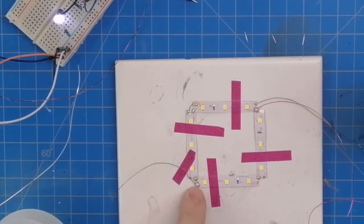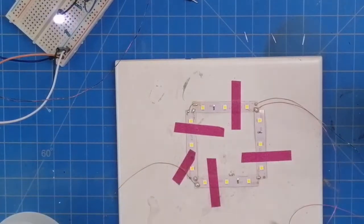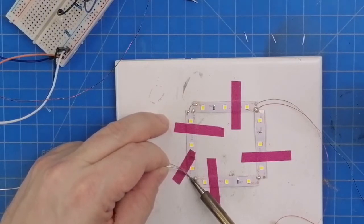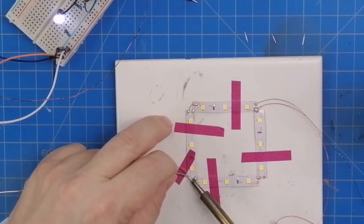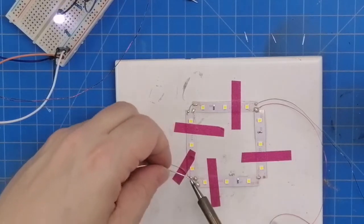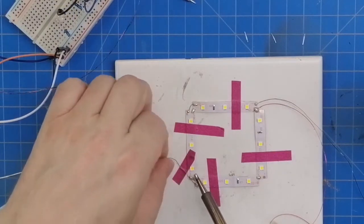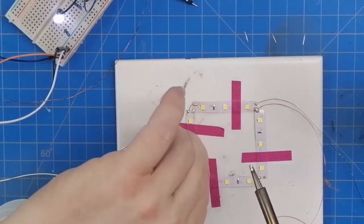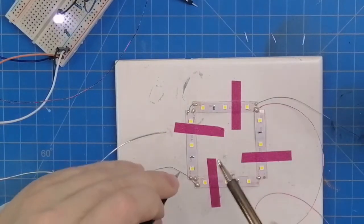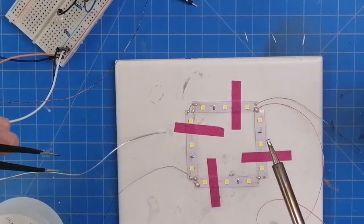So this is the one that I did inadvertently off camera. This is the one that I'm about to do. There's some buildup of solder on the tip. See there, the wire is fighting with me, staying outside of the solder bubble. So let me get the wire. Actually, let me pull this tape. It's on the very edge of the bubble, not a good join. So let me grab it, shift it. Now it's inside of the solder bubble.